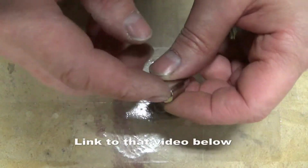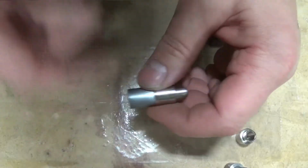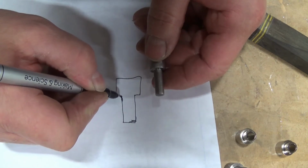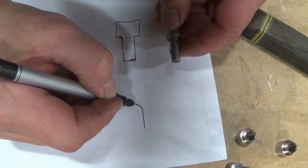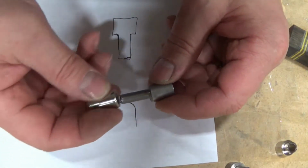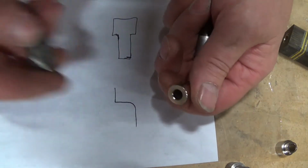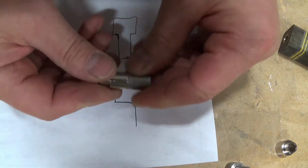In a previous video I talked to you about the bushings not seating on the turn between center, because of the way these are cut. In this corner here it's actually curved like that. A little bigger, it comes down the side and then it curves like this. What happens with new bushings is that the bottom side of this is a square corner, so when you put these together, they don't mate together. There's usually a little gap there. So what I do with new bushings is I take a countersink and just chamfer that inside corner a bit so it seats down flat onto the bushing.